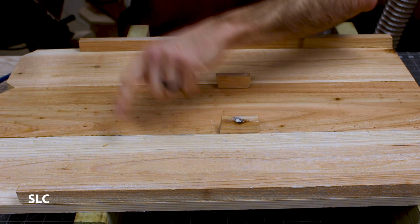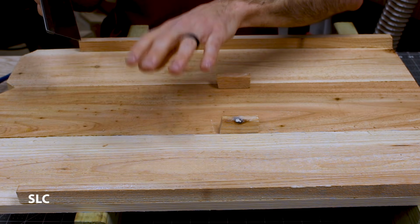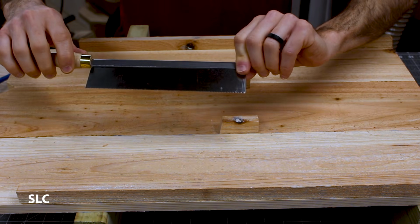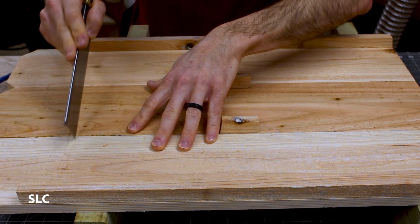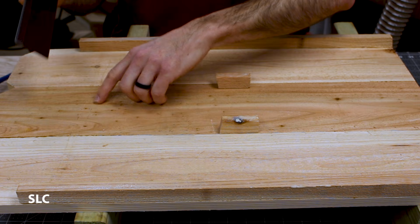Now, even though I just put some glue on this, I almost forgot a step, and this is extremely important. You need to put some grooves in all your boards. A lot of people will tell you to do it with a table saw and other things, but you don't need them that deep. In fact, just take a little hand saw, and all you need to do is etch across. They need to be about 1/4 to 1/2 inch. They don't have to be super deep.